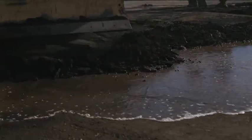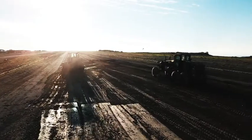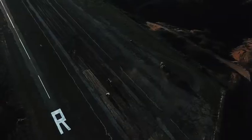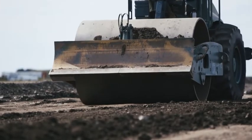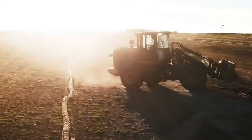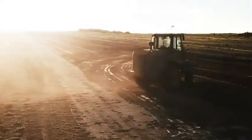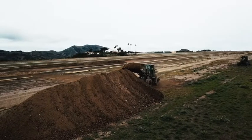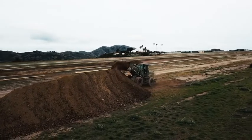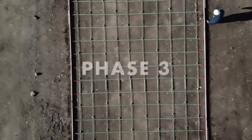Our role as heavy equipment operators is to make sure the ground is prepped, compacted, and all at grade before the combat engineers come out and lay their concrete on it. We'll survey it, see where we need to cut, what's high, what's low, make those cuts, put in a crown, and then roll it so it's nice and compacted so the concrete can sit nicely on top. Essentially we're making an expeditionary runway, and then the combat engineers make it permanent by putting the concrete on top. Once the heavy equipment is done with the earthwork, the construction effort begins.